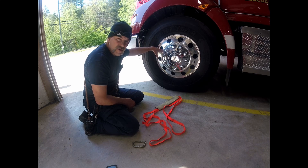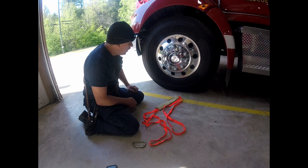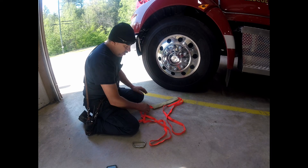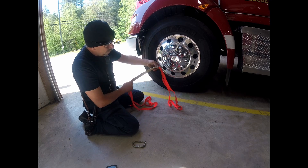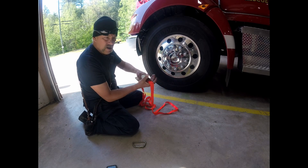If this vehicle goes to a wreck or over the bank and we've got to rig an anchor, this is going to be hot. If you stay out here on the rim, you're probably going to avoid that heat. So I've threaded my piece of scrap fire hose on there — this is inch-and-three-quarter hose.